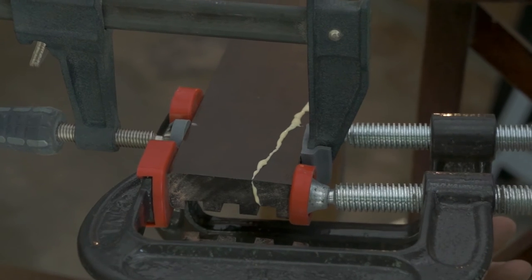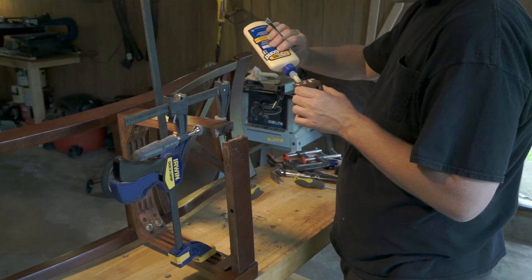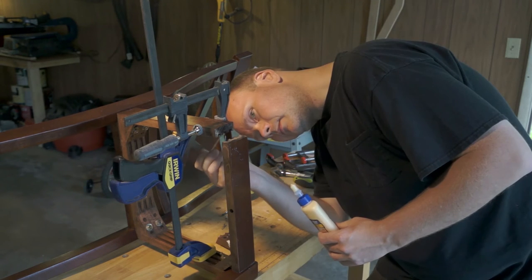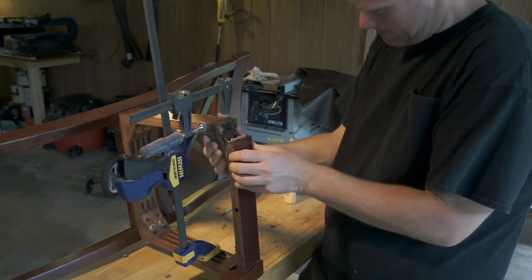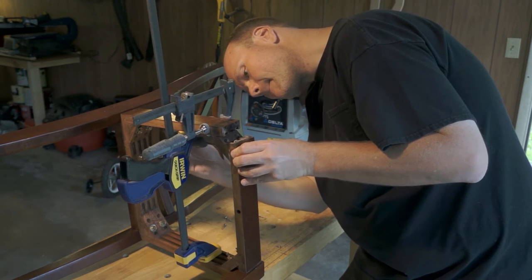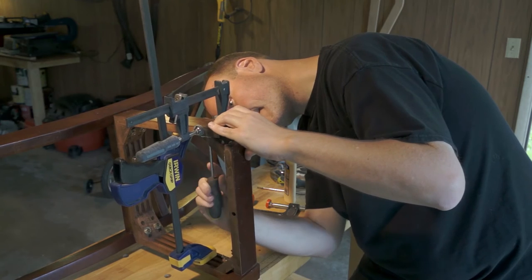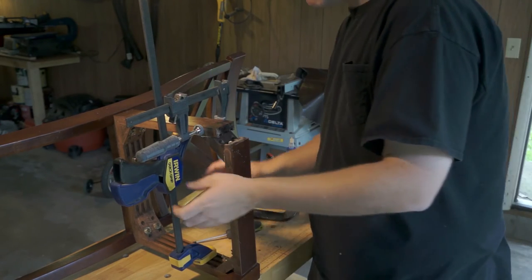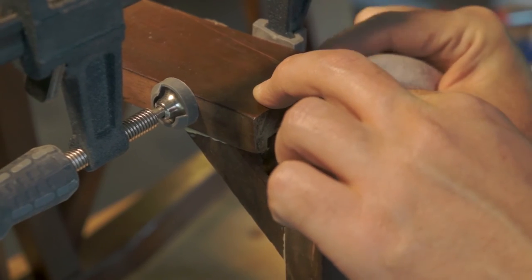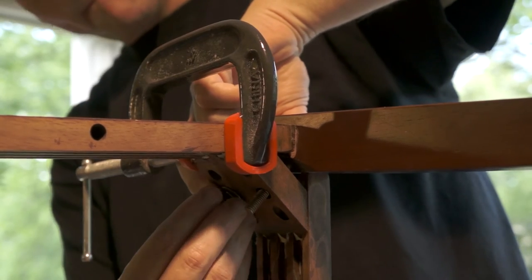After that glue dried for several hours, I reassembled the joint. I reversed a clamp to use it as a spreader bar so that I could remove tension from the joint while I worked on it. I again put a good even coat of glue on both surfaces and put it back together. The screws help to seat the finger joints back together pretty tightly. I left one clamp on the repaired rail to make sure driving in the screws didn't force that glue joint back apart. I wiped up the glue squeeze-out, let it dry for several hours, and then reattached the leg. The leg is nice and strong now — no wobble at all.